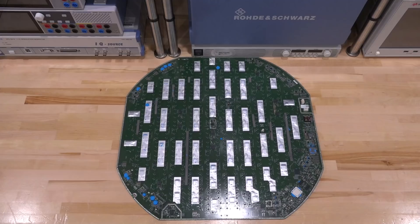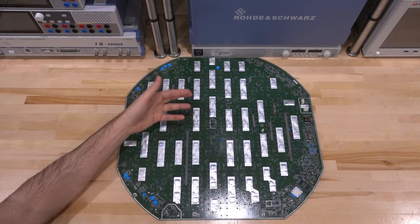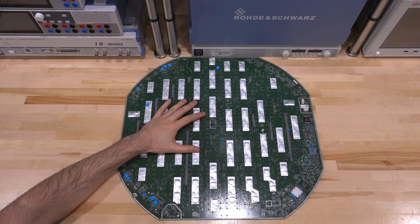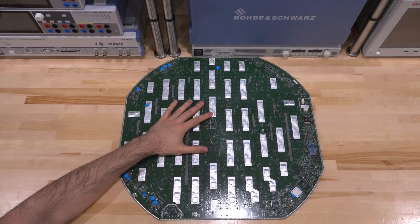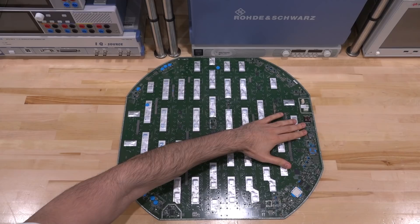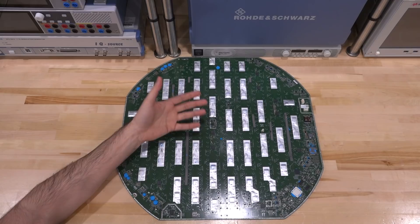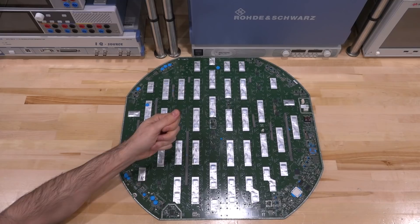Here's the main PCB — it is beautiful. Look at how many chips and ICs are on there; it is a really large-scale engineering effort. This entire thing is designed with Power over Ethernet and a single Ethernet interface, which is quite convenient for consumer applications — only one cable. The power is separated from the Ethernet traffic; the Ethernet traffic is handled by a chip we'll discuss shortly. Another connector goes into two ICs which control the motors externally to move the array mechanically, so all of that is enclosed in a single cable.